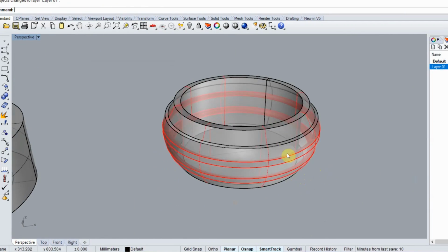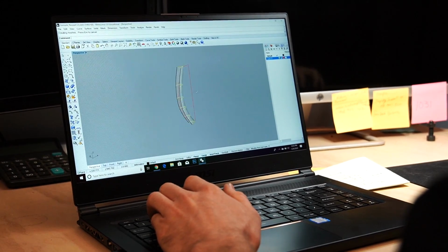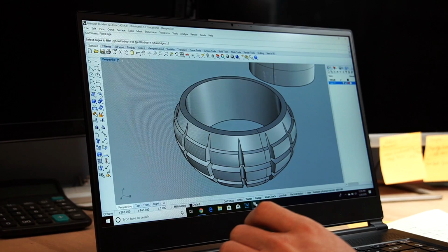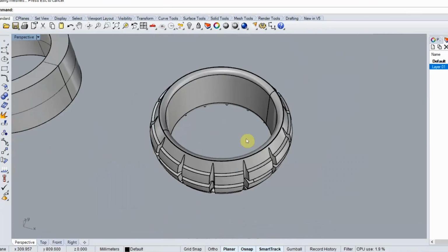To make this a true pineapple grenade, I'll have to add a waffle pattern to the outside of the ring. So I'm gonna start with horizontal cuts first. I'm just using an extruded half-ellipse shape to cut these portions out of the ring. As you can see, it's looking pretty close to the final product, so I'll just add a comfort fit to finish it off.